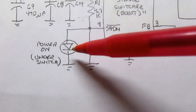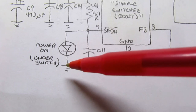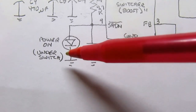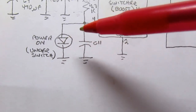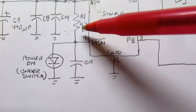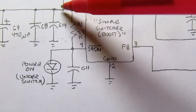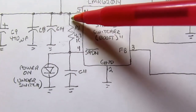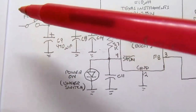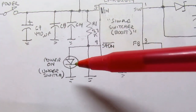And I'd looked before and seen that the power LED, which is underneath the power switch plunger and, via the light pipe functionality of the actual button, illuminates the button instead of being a separate LED that's visible from the outside. And I didn't see a resistor near it, and wondered where the current limiting resistor was. Turns out they're pressing this pull-up resistor into double duty. So normally the power coming in here goes through the current limiting resistor through the LED and indicates that you've got a power source, battery or auxiliary power source, and the power switch is closed. That'll turn the LED on.